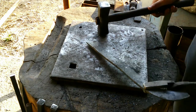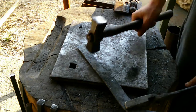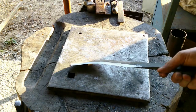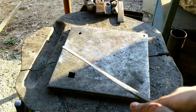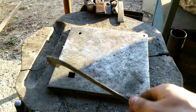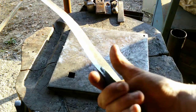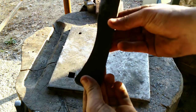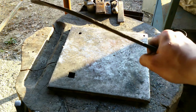Okay, now we're going to put an edge on it and then we're going to quench it. Okay, I've now added the edge — still need to heat up and quench it, temper it. It got a slight warp when I was cooling it down after forging, so now we're going to fix that. I've only sanded this — the handle is nice and comfortable, very basic shape. So let's quench it.